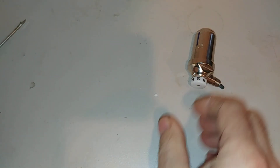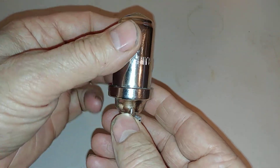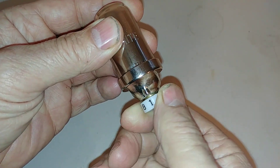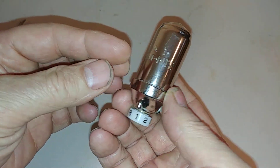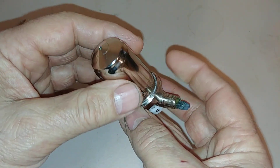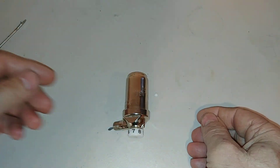So that is the Vent Rite Number One — a very nice bit of kit, and recommended where you wish to adjust the amount of venting on a single-pipe steam radiator. As always, I really appreciate your support. I hope this is helpful in guiding you on how to balance your single-pipe steam system. Happy steaming!